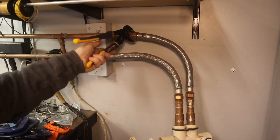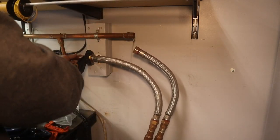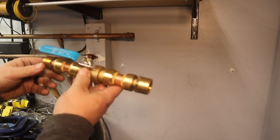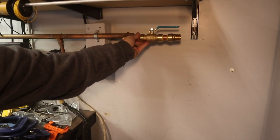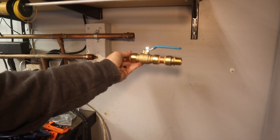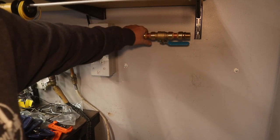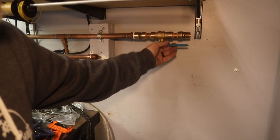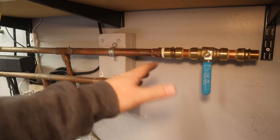The pipes weren't fully drained. With those out of the way, I can now add a shutoff valve here to the inlet. This way I can turn off everything right here rather than going out to the sidewalk or to the other side of the garage. Here's a good example of why I really like the SharkBite connectors — with this being tightened all the way down, my shutoff valve isn't where I want it, but with SharkBite the connections stay movable, so I can do my installation in stages.